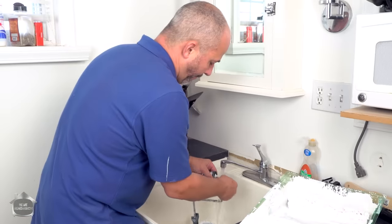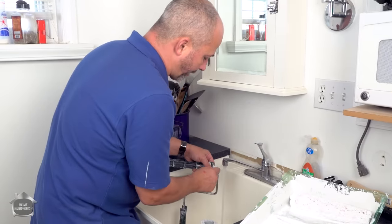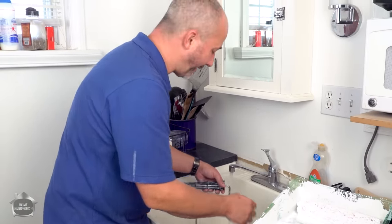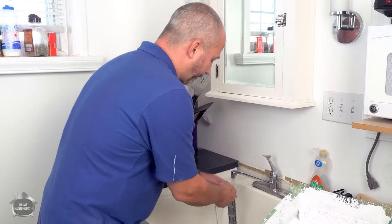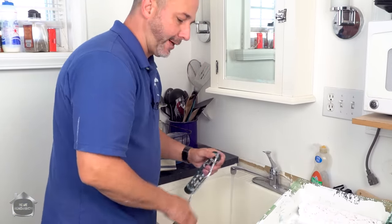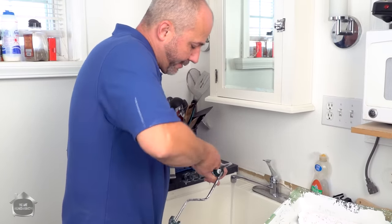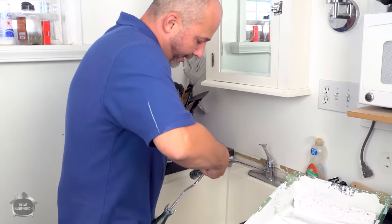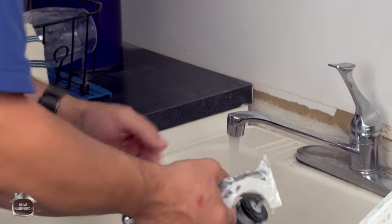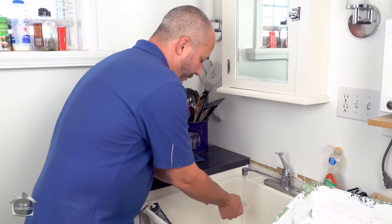There we go. The outside here as well, because this is a spot where paint builds up. It'll break off when you're loading your tray, and then you'll have a chunk in your paint. And your goal, as long as this spins freely, you're good to go. If it doesn't, you might need to take your 5-in-1 and get right in this little groove in here and clean dried paint out, okay? Make sure that this spins freely. Hang it off the side of your sink here.